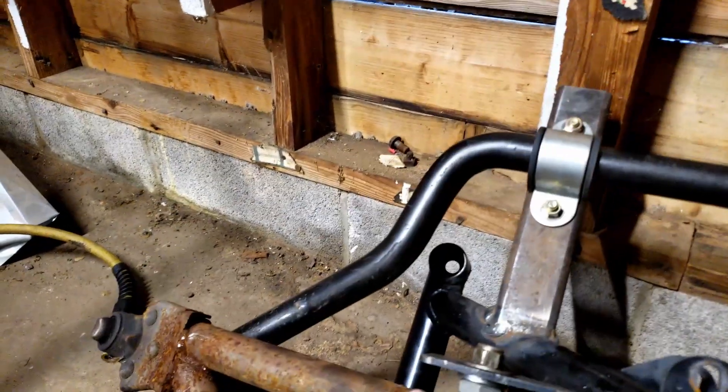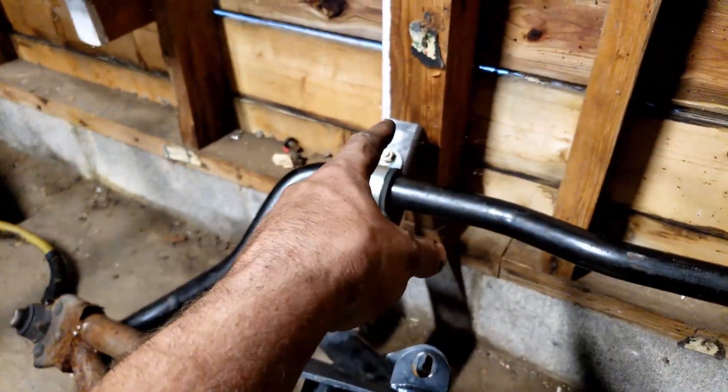The only other thing I need to do is get the end links made, and then put those caps on the ends. That's about all I'm going to do today — man, it is hot out here. At least we got the mounting points secured and the sway bar actually mounted. The actual mounting brackets for the bushings have a little oval-shaped hole so they can move back and forth for some extra adjustment, and where I have it now is about where we set it in the last video, so in theory it should clear the spindles and tie rod. I'll get more big cut-off discs to cut the end pieces, get some nuts and bolts, and then we can get back in the car after a little more work on the control arms. If you haven't already, go ahead and subscribe, like the video, let me know in the comments what you think — I'll see you guys later, thanks for watching.